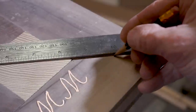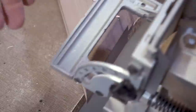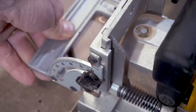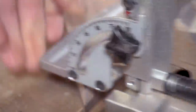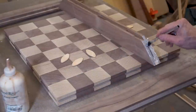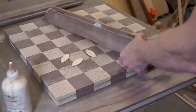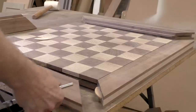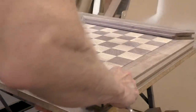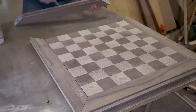Because I have the tiger maple banding around the outside edge of the frame, I'm not going to use corner splines — I'm going to use biscuit joints instead. I know that biscuits themselves don't add a lot of strength, but they do increase the surface area of the glue and that will add enough strength to hold everything together. Having the biscuits in place definitely made it harder to put the frame together, but they definitely helped to make sure that everything was properly aligned.